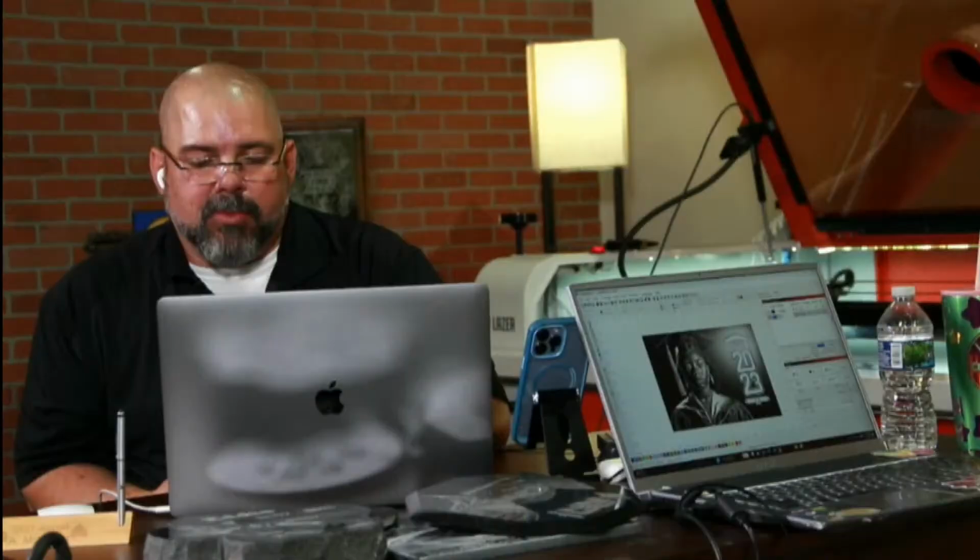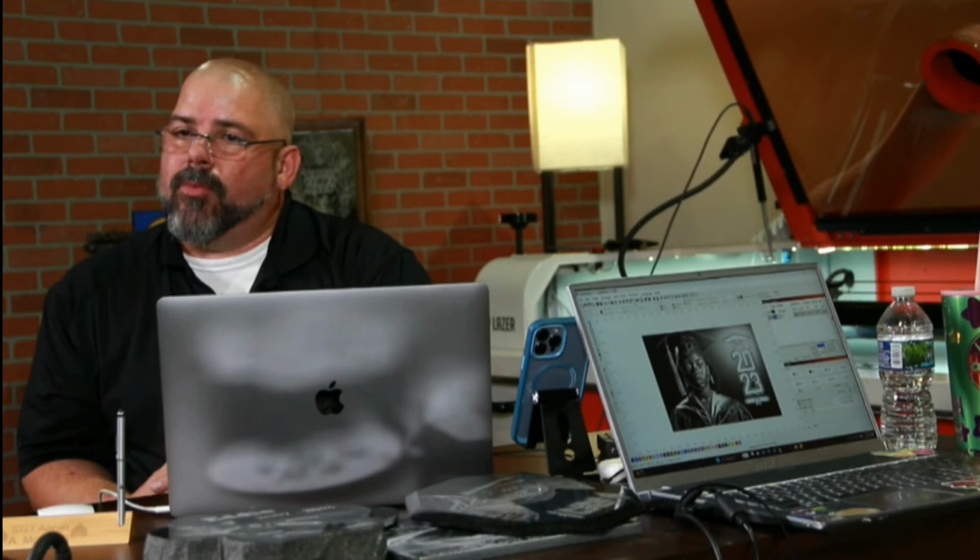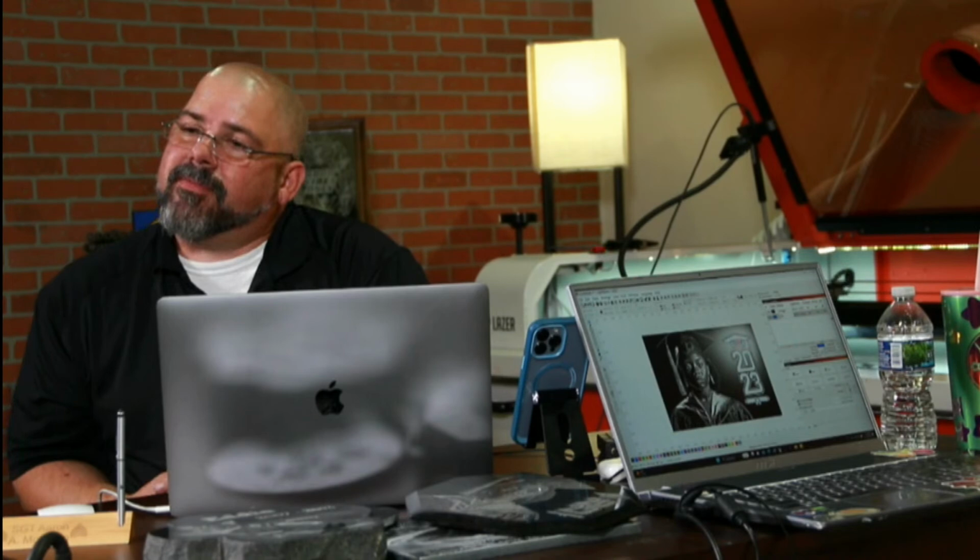He did clarify his question was actually what lens, not sense. Lens, okay. Let me get back into the science, because it's a really great question. We are using a 2-inch lens. Like Frank mentioned earlier, he will use 200 DPI for a 1.5-inch lens and 150 DPI for a 2-inch lens. That's his preference. So that does definitely indicate that you can use a 1.5-inch lens for granite.